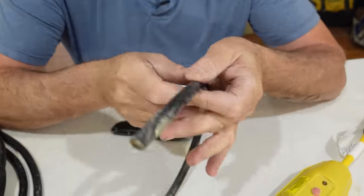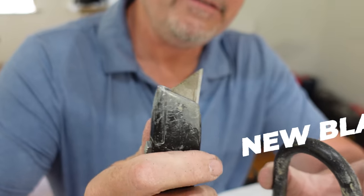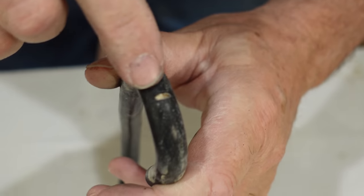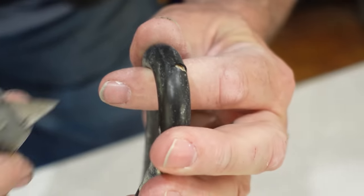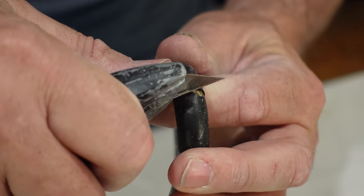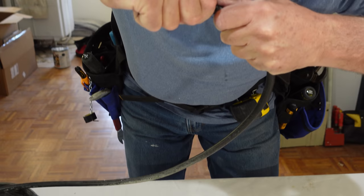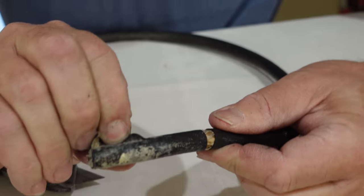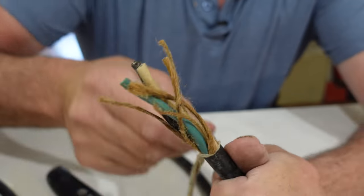Next thing we've got to do is remove the sheathing from this cable. I'm right-handed, so I'm using my left hand to bend it and stress this part of it. I've got a new blade in my utility knife and I'm not going to cut — I'm just going to press and watch what happens. I can just see the braids inside. I'm going to press again, and because I'm flexing it, it's just going to open up just like that without damaging the wires inside. I'm going to have to slit and tear it, which is what I want. That's some old cable — that's the good stuff.